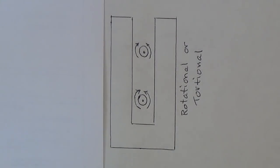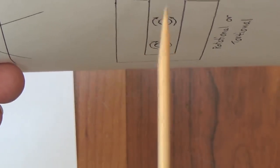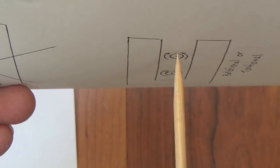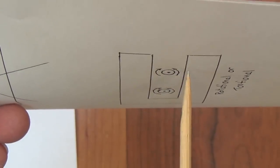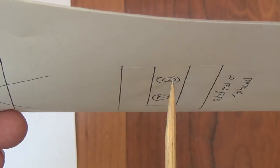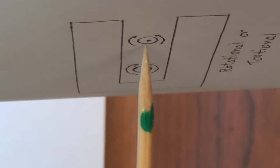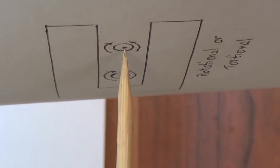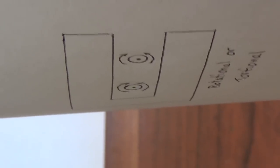In the best position, the weight of the springs will be borne equally at both ends of the tank. The second best mounting position — imagine the tank is vertically aligned standing up from the bottom to the top of the cabinet — gravity will not cause the magnetic rods to drift toward the laminations, allowing them to remain properly centered. The problem with this arrangement and why it's second best is that the weight of the springs is not equally distributed: the weight for the upper transducer is minimal while the weight for the lower transducer will be maximum, and this uneven burden will no doubt affect the propagation of the waves through the spring.